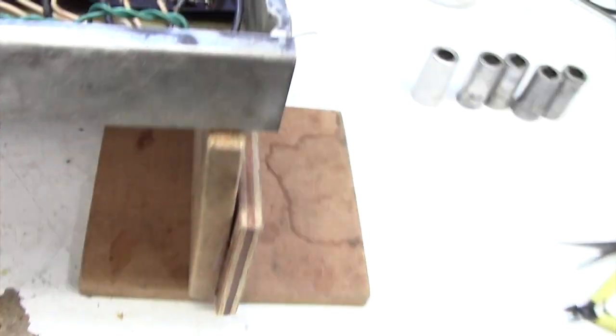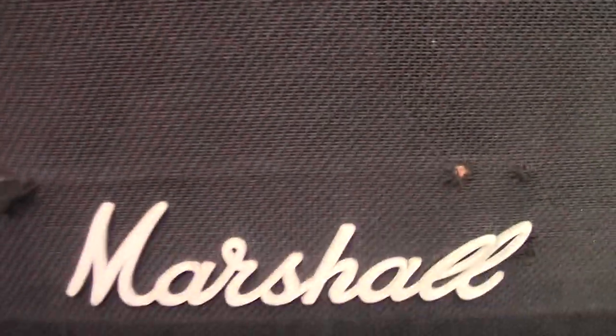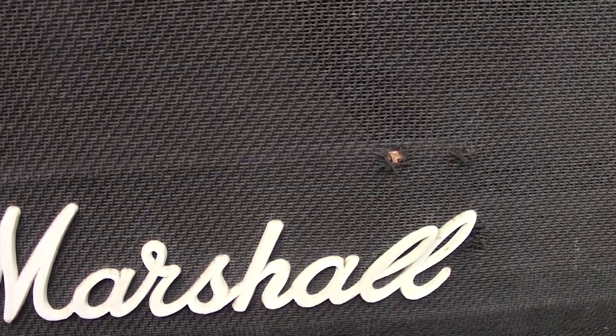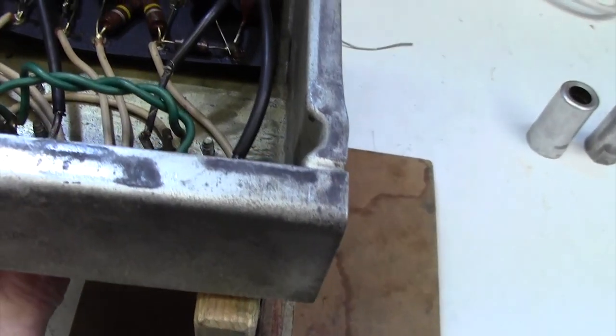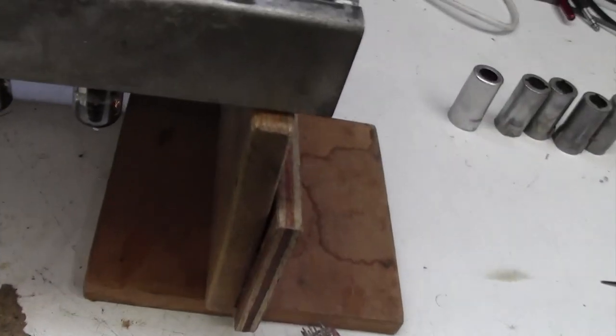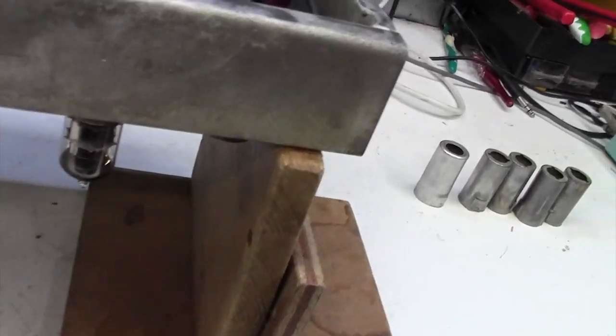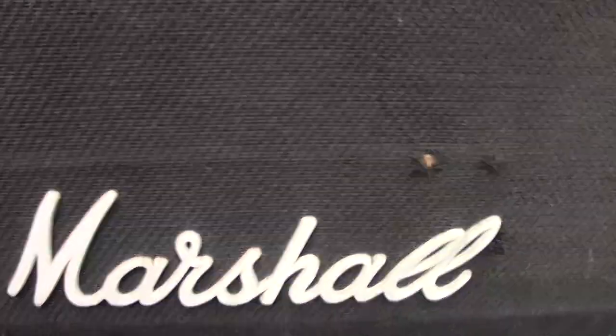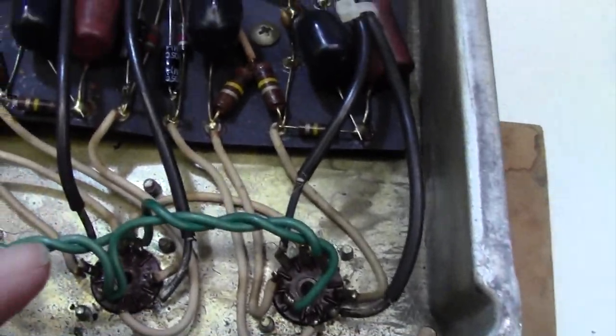I can still hear it. High frequency chuntering away there. But that has removed a lot of the noise, interesting. Let's put that one back. There we go, that's back in. It's just warming up. There you go. Okay, well, a lot of that low frequency noise is coming from that valve area. Okay, we have changed it, but I'm just going to change it again just to be absolutely sure. I've put the valve from V1 into V2 and it's still exactly the same. So it's not valve related. It's something to do with what this valve is doing.